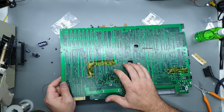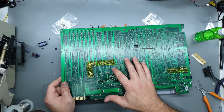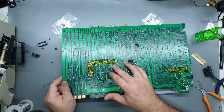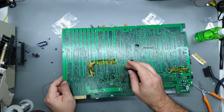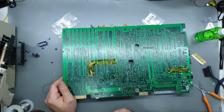Yeah, the one that's supposed to be surface mounted, I did accidentally desolder that again, and then lifted the little pad from the bottom. Luckily, it's designed to be surface mounted, and there's not a trace coming from the bottom of it. Which one is it? That one. So yeah, not a big deal there, luckily.